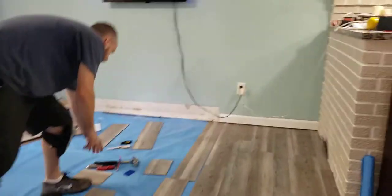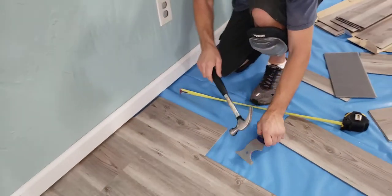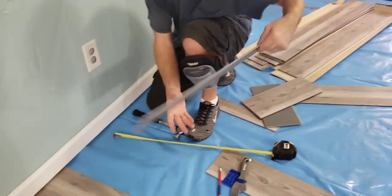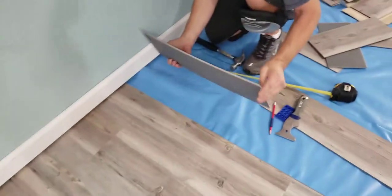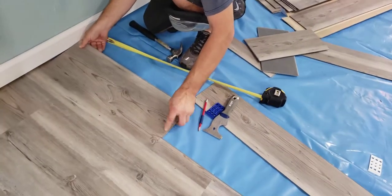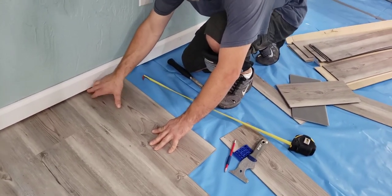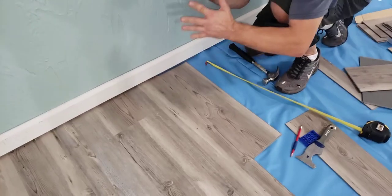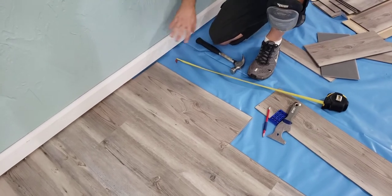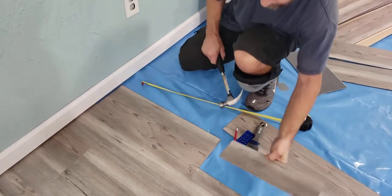Make sure it's square — the seam opened up even though I pushed it in, so I'm going to make sure it's seated. A lot of times you just use your hammer and tap down on it. Don't worry about scratching these, but just don't hit it on the side. I'm going to lift it up and get it closest to the woodwork as possible. Sometimes you may have to take the woodwork off to drop it down, but I just painted mine, so I'm going to put the quarter round on instead.